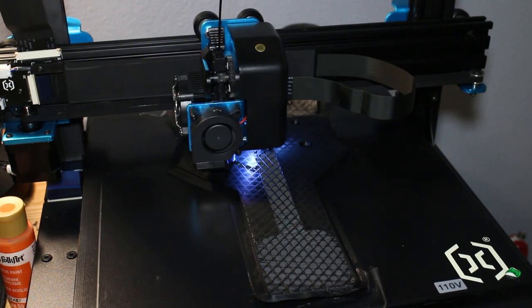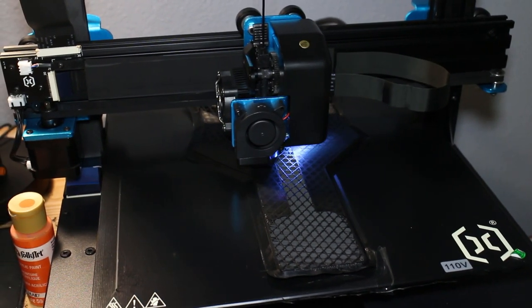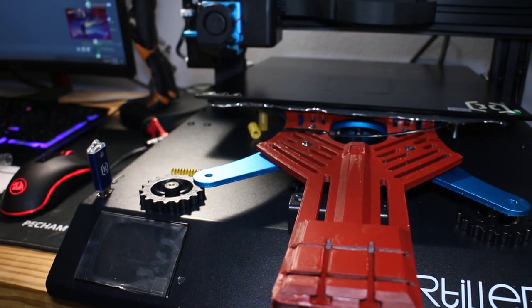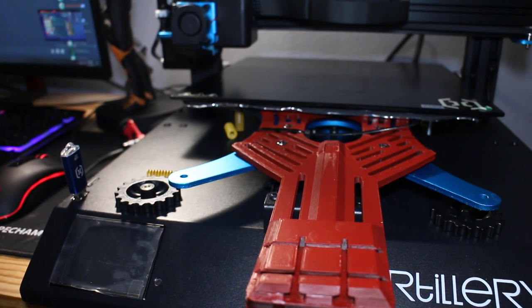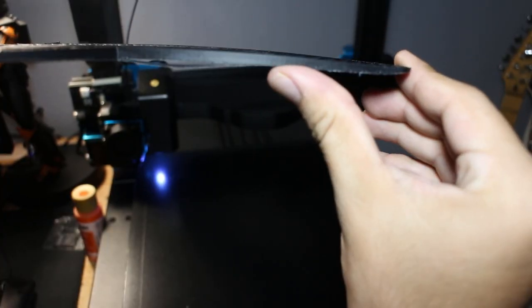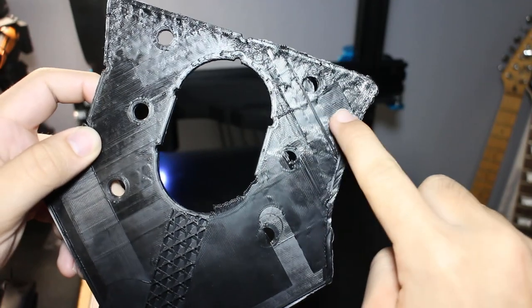The GoPro mount goes mounted underneath the bed plate, so as you can see it was a pretty complex design. This is where the printer did have a problem — as you can see on this plate, there is some warping towards the front and towards the back. I decided to split print it, but when I glued it together I realized the warping was still there and the pieces didn't fit as they should. I wasn't surprised this happened given that I was printing in ABS.